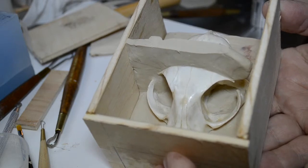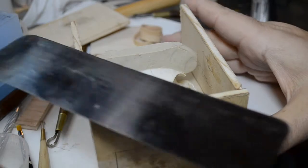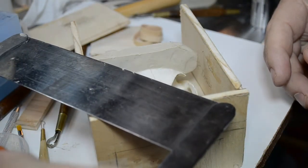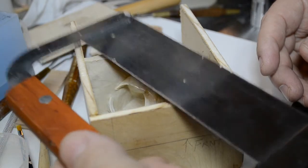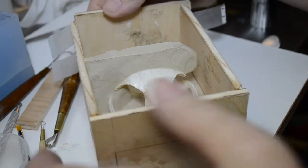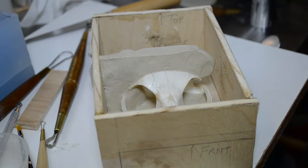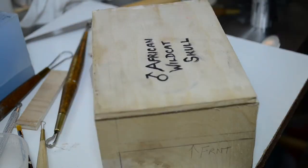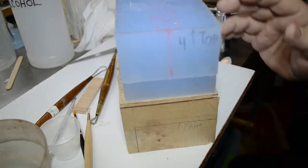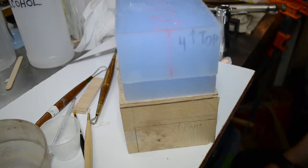I went across with my large clay cutter and evened off the top. I simply laid the cutter across the wood and gently worked it across until I cut the clay piece flat. This allows me to completely cover and encase the box, and then allows me to place the cover on top until I get back to it tomorrow. I took the original mold and simply put it on top to weight the top down on the wooden box. This keeps dust from falling down into the mold onto the clay — keeping it as clean as possible. I'm real pleased with the way this is coming along.